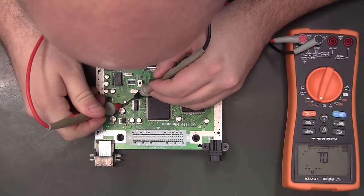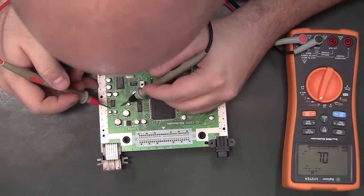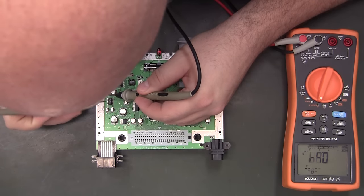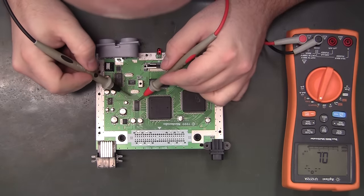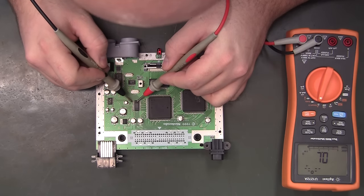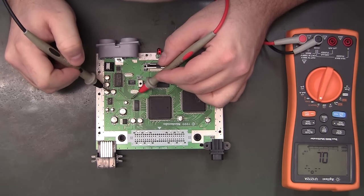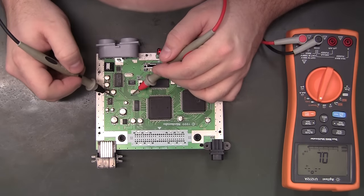So, that one right there. Pin 18 of the MAV is a 10 microfarad to ground, and I want to say 24 was, okay, it's on 14, and 28 was on 2. I did find one reference to the MAV chip pinout, but I couldn't find anything on the AMP, and it said something about pin 18 being REF SND, which I assume is reference sound, because I think a couple of these pins do go to the AMP chip. So if it's sound, I'm a little leery of replacing with ceramic.